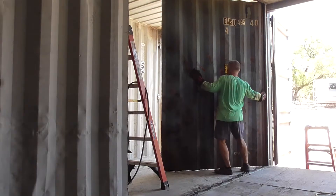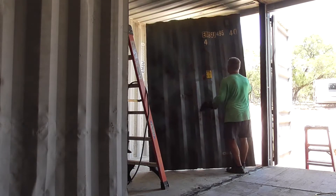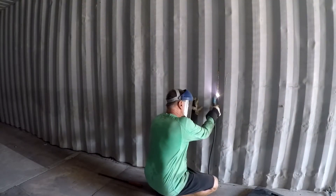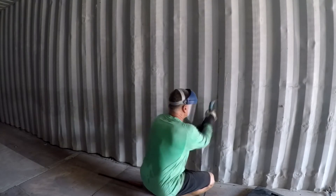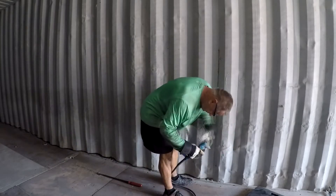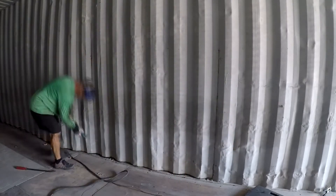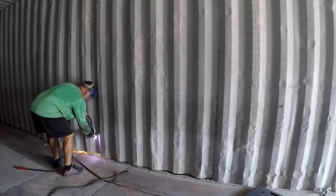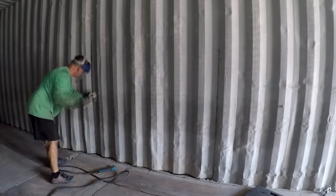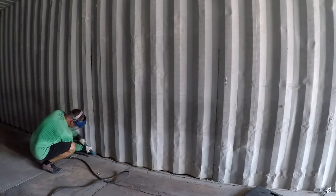After cutting the top, some of the pieces were frozen together. Just moving these things out and dropping them out of the hole. Here are my seaming cuts — the vertical cuts. I just find a groove where I can put the tool and it rides nice and straight. I'm going to reuse some of this material for the floor in the living room, so I'm trying to make nice cuts because I'm going to weld them back together, then fill with concrete.